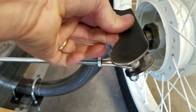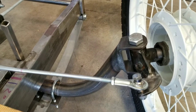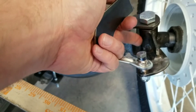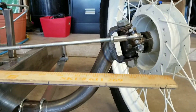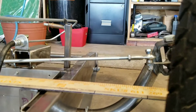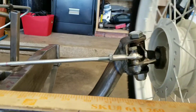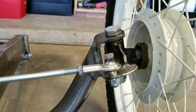What we're going to do is rebuild these parts and reattach them at an angle. Right now there's an angle in this, and the new one is going to be basically level with the ground. We're going to fix that by attaching new brackets level with the ground instead of offset. Right now they're square with the kingpin, but that puts an angle in for the kingpin inclination. You can see when you twist it the axis changes as the kingpin goes through its travel — so we're gonna fix this by cutting these apart, welding on new parts, and getting rid of that binding.